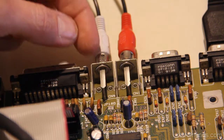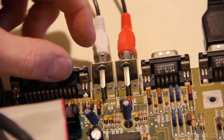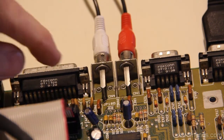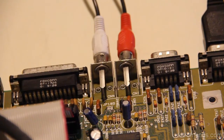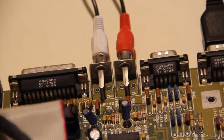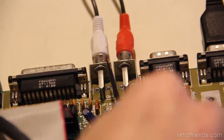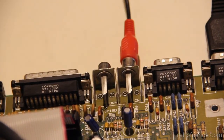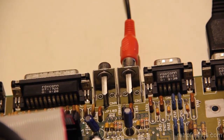you know, there's the center pin, the tip of these RCA jacks, you know, slides in and gets captured, and squeezes itself into a contact that is directly connected to this bar. And that contact, over the years, it will sort of wear itself open, after maybe people yanking on it sideways or just through use or whatever. So I just took this pick with the jack out. I took this pick, and I don't know if you can, I guess maybe I'm going to get a shot of it close up with the macro.